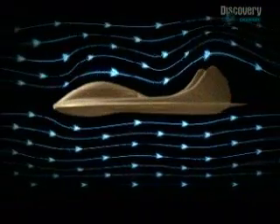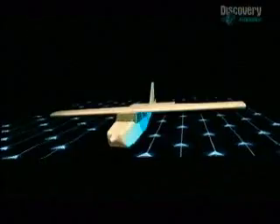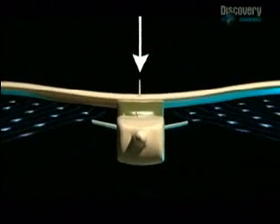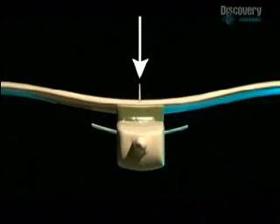In fact, Geobat's wing design could reduce wing-tip vortices — the spirals of air which sometimes reduce lift. The vortices are distributed rather than concentrated like on most aircraft. You may have very good benefits as far as efficiency and maneuverability. But John's most impressed by the structural strength that Geobat's aerodynamics make possible. Conventional aircraft have an inherent weakness in that only the wings provide lift — the fuselage carrying the payload is dead weight, producing downward pressure. The fuselage does not in most aircraft designs produce any lift.